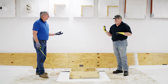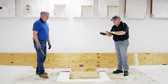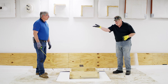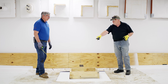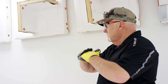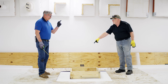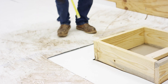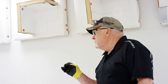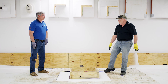We have fresh membrane on the bottom side of our original roof because it really hasn't been exposed to the elements — no dirt, no UV, and so forth. By going underneath, we have two things going for us: we can take a cleaner on a rag and give it just a light wipe, then do a weld old to new — old gray to new white. We're going to do our base attachment around our curb 12 inches on center. Would I need base attachment out here on the field? No, because we're actually welding to a sheet that's already mechanically attached, so we don't need new fasteners. We do need base attachment on the curb itself, and now we can flash out onto the new white sheet.